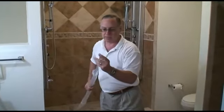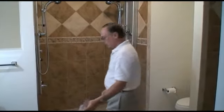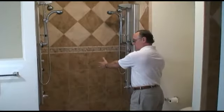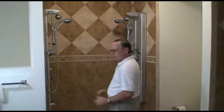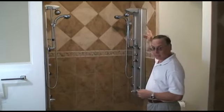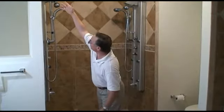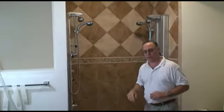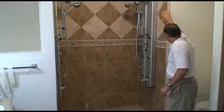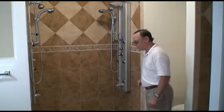In this case, I'll be using one where the door and the panel come together. This door will be located on this side of the shower and the panel will be fixed right here. This one will be done without a header, which will be fine. I'll do a sleeve over to secure this panel and silicone it in place. On this side, the door will be hinged on the wall into some studs. There's wood back behind here, which is the best installation.